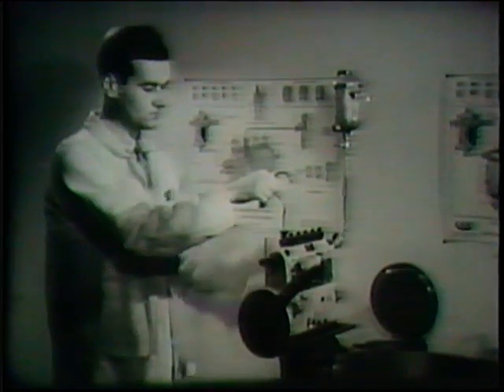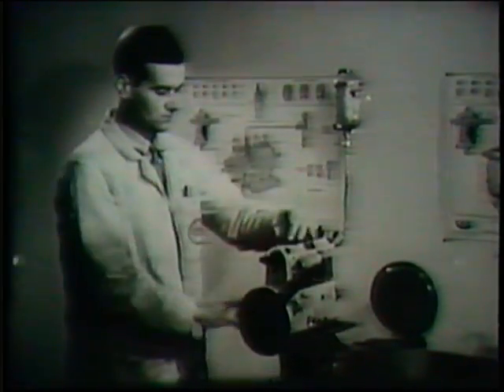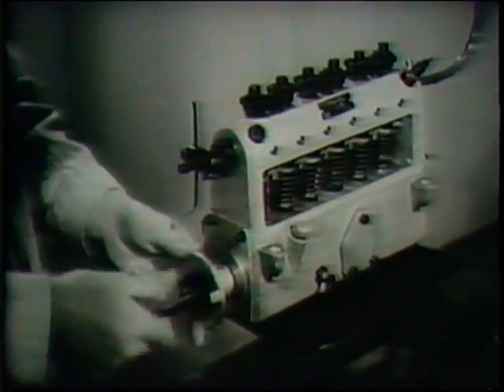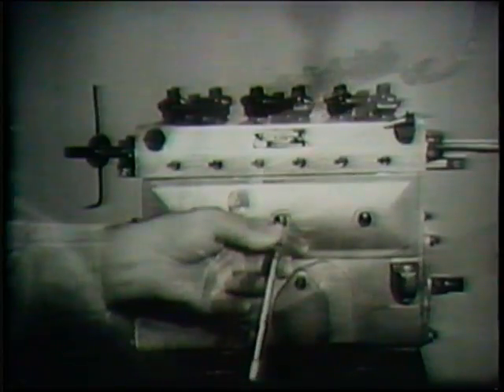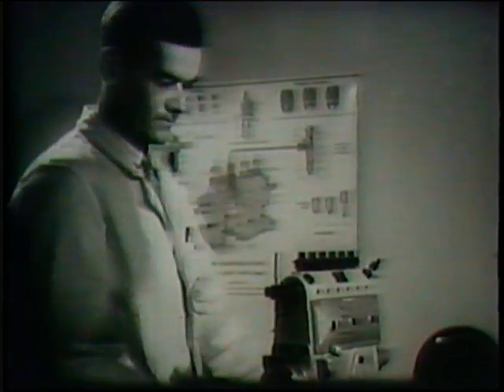The coupling is held steady so that it may be scribed with a line to coincide with that already marked on the pump end plate, or in some cases on the timing plate. The operation is now complete and the valve assembly is refitted. A few turns are given to the camshaft in order to clear the pump of any oil lying in the suction chamber. It should be remembered during all these tests that the camshaft must be turned in the direction of rotation in which it runs when fitted to the engine. The inspection cover is refitted, the fuel container removed and the pointer taken off.